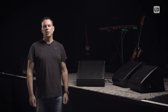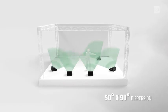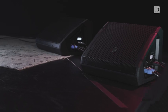A larger diameter gives us a lower crossover point and we get better control of the directivity. In contrast to horns commonly used in coax speakers, the Mon G3 uses CD horns that have been specially designed using the boundary element method. This minimizes distortion and gives us precise control over the dispersion. The CD horns radiate 50 degrees horizontally and 90 degrees vertically, which gives us great control in the depth of the stage, but also good separation to neighboring monitors.